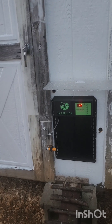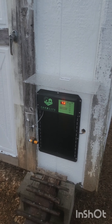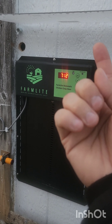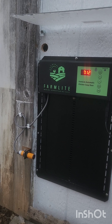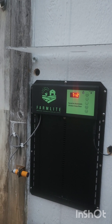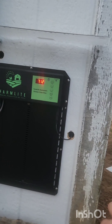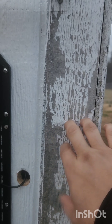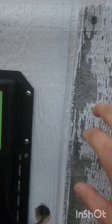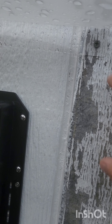There she is — there's my door. Look, it has this little rain shield, which is clearly working. You do need a bit of a skill set because the idea is that the door, when it comes up, goes up behind the rain shield. You want to set the rain shield about half an inch to an inch away from your wall. He suggested using little blocks, but I didn't want to do that — you run the risk of splitting a small block and you have to pre-drill holes. I already had trim that sets me forward about three-quarters of an inch so I just drilled straight into that.